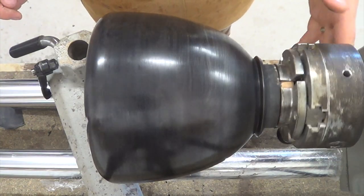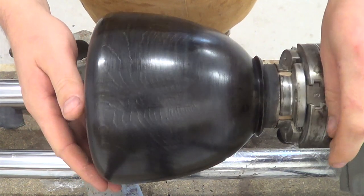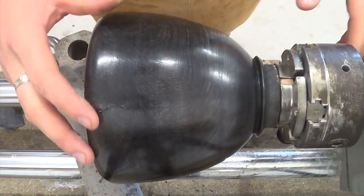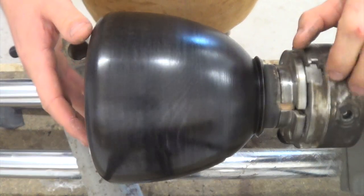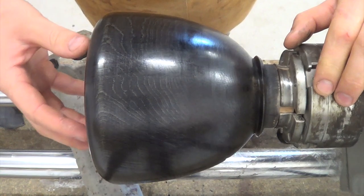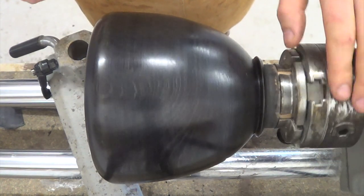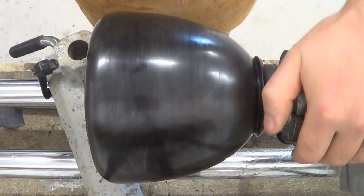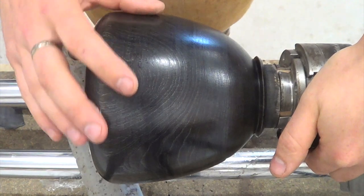And here it is, fully polished. I have to say it is looking pretty good — it has turned out better than I hoped to be honest. I was worried that this process wouldn't work very well on beech, but using the tannin solution that I made up has worked really well. I prefer this to ebonising lacquer. I've seen the lacquer used and it makes it look like it's not wood anymore — it looks like it's just been spray painted with a glossy finish. But with this you can still see all the grain of the wood. It looks gorgeous.